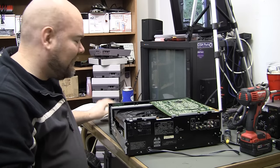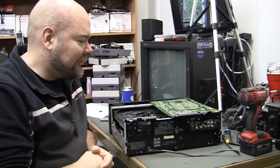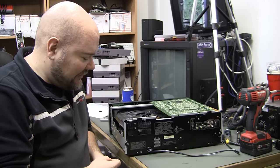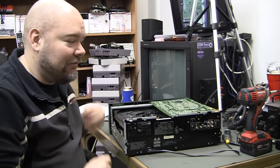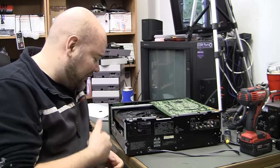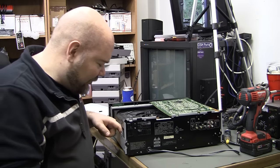A little more research — Blue BMW, who is a pretty well-known respected modder in the community, posted like five years ago some info about the laser active. Since I don't seem to have a gear problem but more of a power problem, I went back and rechecked. He does say that there could be a 5-volt rail problem on the power supply, even though I do seem to have power. When the buttons are non-responsive, he thinks there's an IC protector — they're called ICP-N25 and ICP-N50. I can see them written on the power supply board there.